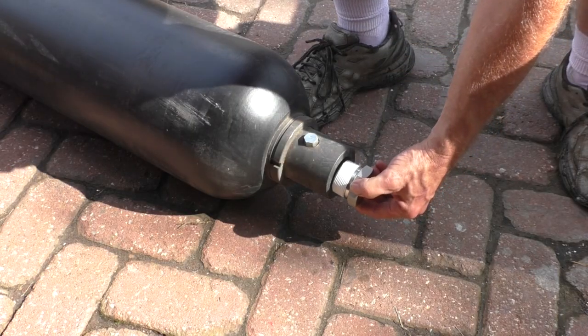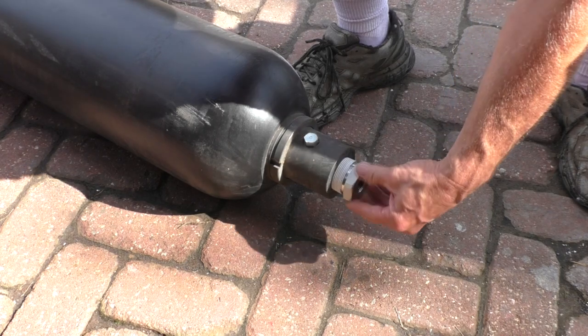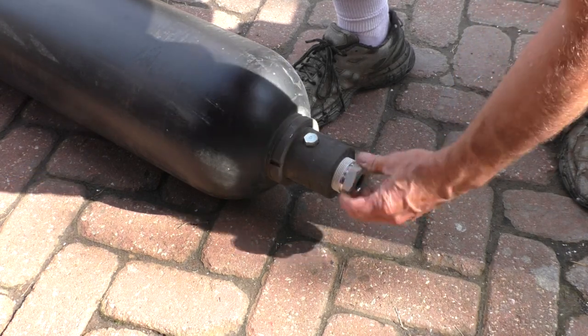on the pressure difference. So we'll put about 2,000 PSI of pressure into it, and it will work down to about 1,300 PSI. So we get about 700 PSI delta, but we get at least 2 gallons of oil. Yeah, it comes with an inch and a half thread on there, but we're gonna reduce this way down to something more appropriate for us.